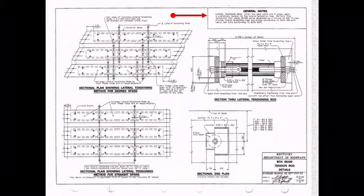So I mentioned earlier the lateral tension rods. These are these lateral tension rods right here. They lock each beam together. If you see here on a skewed bridge, they've got to lock each beam once they get put in because of the skew, but on a straight bridge, zero skew, they can put one tension rod throughout, lock them together, fully tension them. Up here you can note they must be tensioned to 20,000 psi, developed by a torque wrench of 200 foot-pounds. We've got to make sure that they're getting that in.